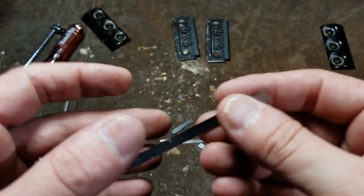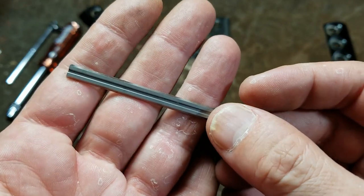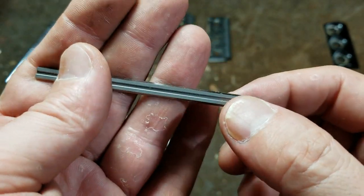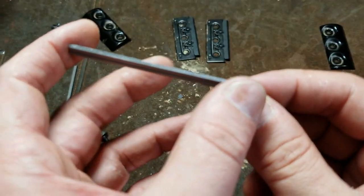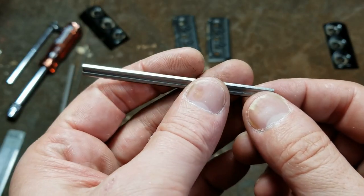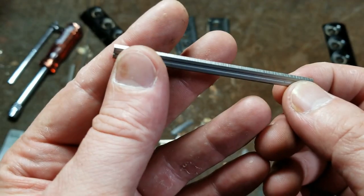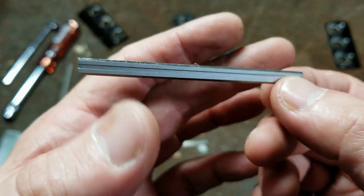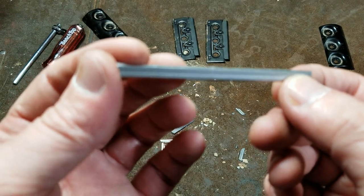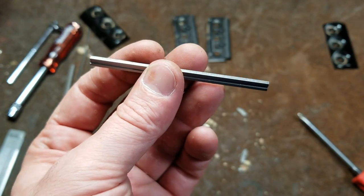Okay, we're ready to get these blades back in. One thing I do want to mention is that I had a DeWalt that I reviewed a long time ago that I since sold, but these blades tend to be 3 1/4 inches wide, and some of the older units actually were made for 3-inch blades, and that creates a problem. The blade's a little bit too wide. All the other dimensions are the same. They're totally compatible, but I noticed once where the blade was obviously a little bit too long. These are the correct width for the Makita, so it'll work fine.